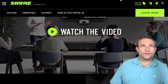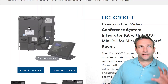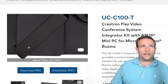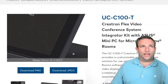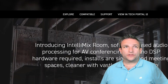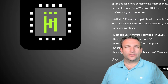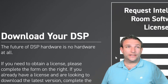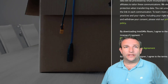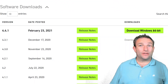This gets rid of old cabling and makes setup super simple. The Crestron hardware is a Windows 10 IoT device all ready to go, and you also have the 10-inch touch panel for the table or a wall-mount version. To get the software, scroll down to the IntelliMix Room software section. If you need a license you can get a trial license there — pop in your details, hit agree, create an account, and that allows you to download both Designer and IntelliMix Room.